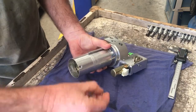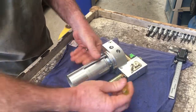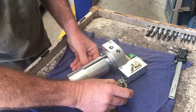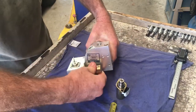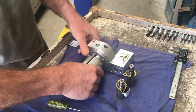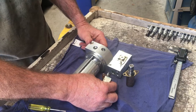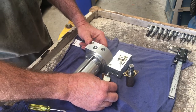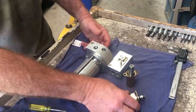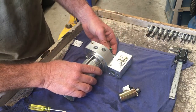To remove the solenoids, there are going to be two screws on each one of them. You can remove that, then just give that a bit of a wiggle — you'll probably need to just get a screwdriver and lever that out to get the solenoids out. Now the solenoids: the bottom one is the one that allows fluid to go back to the reservoir when power is removed from the unit, which is not on the more modern pump systems. Whereas this one at the top is the one that controls the compartment cover at the back.